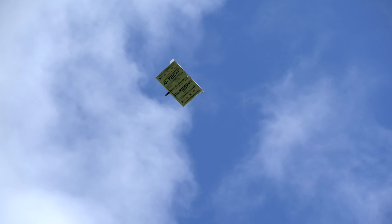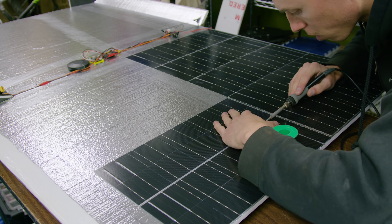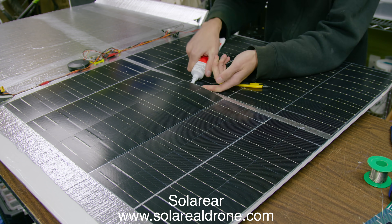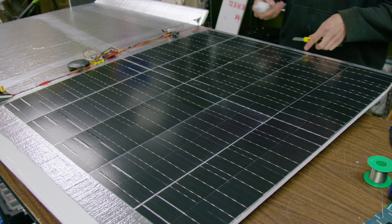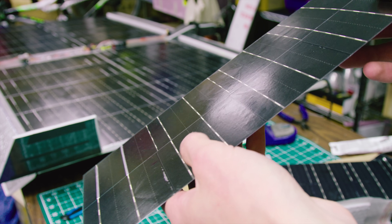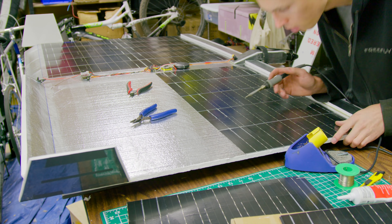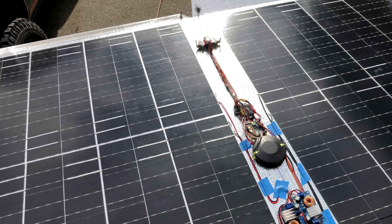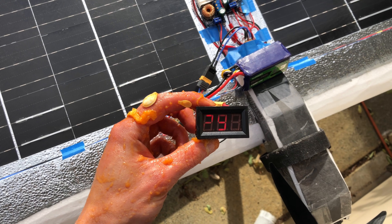At that point, I decided it was time to add solar cells. I used these big 380 by 140 millimeter solar cells from a company called Solar Rear. They're pretty lightweight and flexible, and they're supposed to be only slightly less efficient than the SunPower cells I've used before. They can bend quite a bit before cracking. I soldered all these together and used a dab of silicone glue under each cell to hold them down. The silicone glue is easy to cut so the cells can be quickly removed if needed. With some direct sun, we're doing about 3 amps, which is awesome.